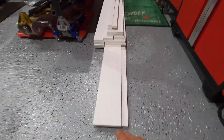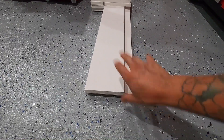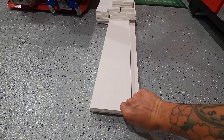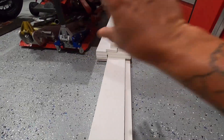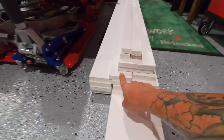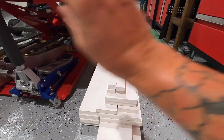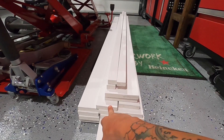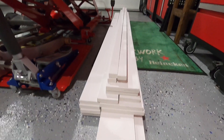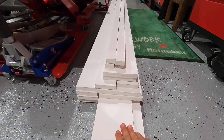First let me show you what I got. I got some one-by-eights — this would be at the bottom where the baseboard goes. Some one-by-sixes — this would be all the way at the top. Then we have some one-by-fours, these are the ones that go up and down. And then some one-by-twos — this would be right on top of the one-by-fours and it will act as a chair rail.